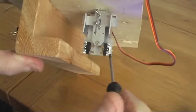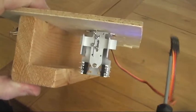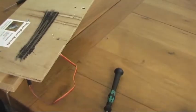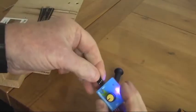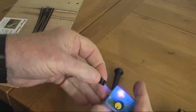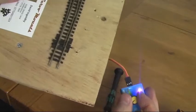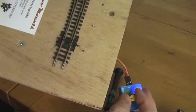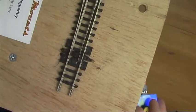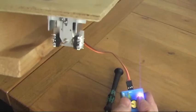At the moment the two switches are set right to the outside edge of the mount. Now we're going to test it. We'll plug on the servo tester again — this time we want it in its normal movement position. Now we can check that the servo moves from side to side nicely. You can see that. So that all works. Put it back in the centre.